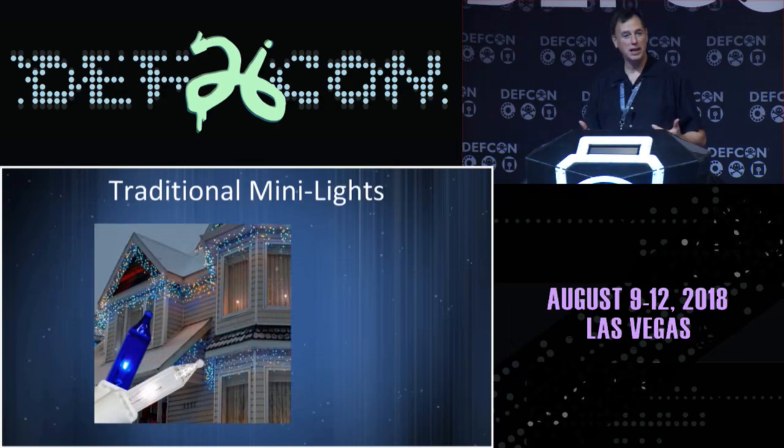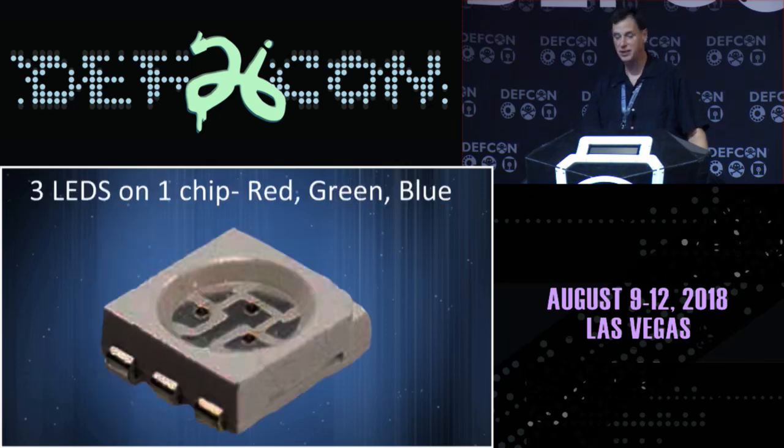So the traditional mini lights, a lot of us grew up with little incandescent bulbs. They're not very energy efficient. They heat up a wire to make light. They're painted to get the color. You grew up thinking about how the local power company would spin your dial when you're running massive amounts of Christmas lights. Technology's come a long way, and now everything in my display is LED driven. DEF CON's been good enough to give all of us examples of these, but the basic element in all of this is an LED chip that has three different color LEDs on one substrate, a red, a green, and a blue. And they're in such close proximity that your eye sees them as one pixel.